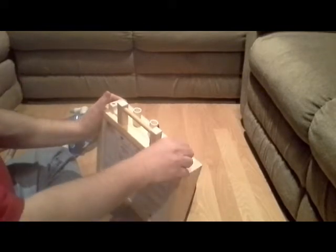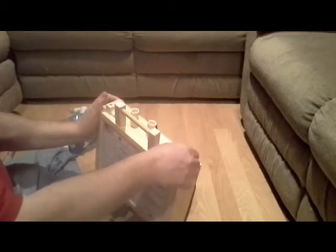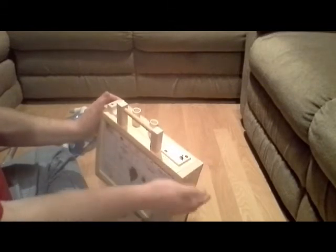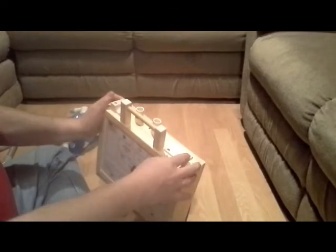I can say low speed, high speed, ventilator, whatever, and switch through the modes by turning it back to on, and then when I'm done, turn it back to off. So you can see that's spring loaded. That gives me the go from there back to on, as long as I do it within a half second. So that's how I'm going to change the modes.